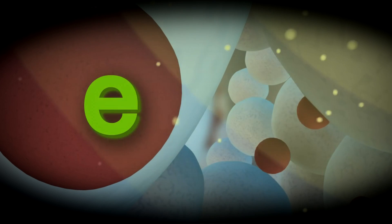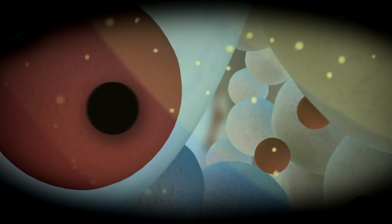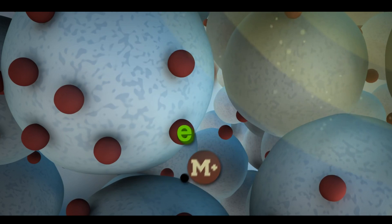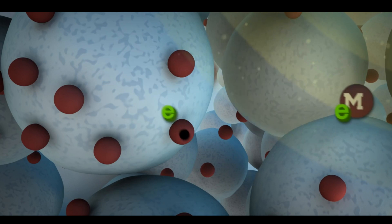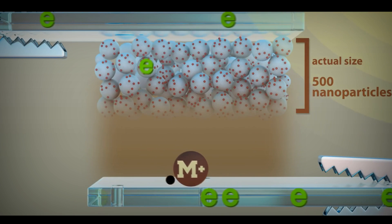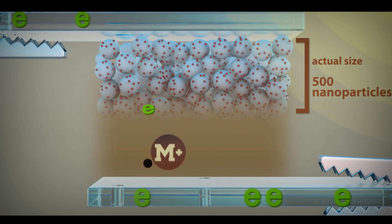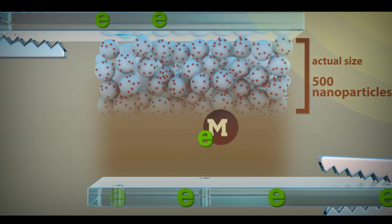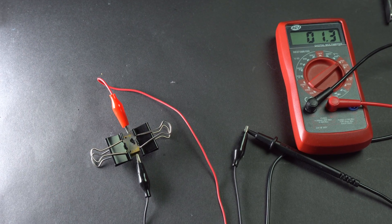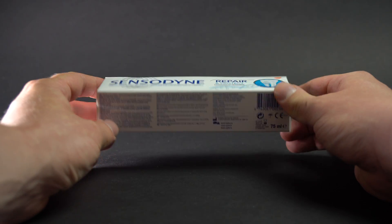When light hits the surface of anthocyanin molecules which are attached to the titanium dioxide grid, the dye molecules lose electrons which pass through the semiconducting titanium dioxide film leaving holes. These holes are occupied by the unpaired electrons which iodide ions have, which are oxidized into triiodide ions, which then diffuse through the carbon film on the other electrode and then reduce again accepting new electrons. This is how current travels inside a circuit.